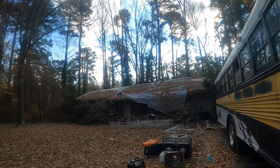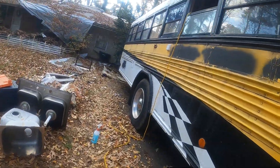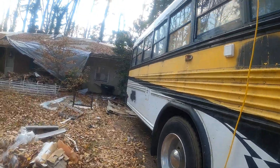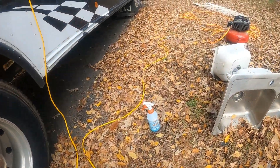I didn't record because of the sound, honestly, but I did borrow an air compressor and I have it hooked up. I'm getting ready to hook it up to that pressure test gauge and I'm going to run it at 20 psi to see how much it leaks over time. I also got a really cheap spray bottle filled with Dawn dish detergent — just a light layer of it and water — so I should see bubbles.